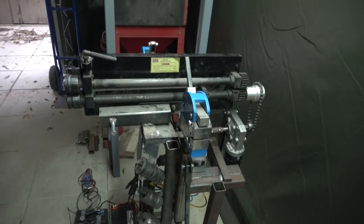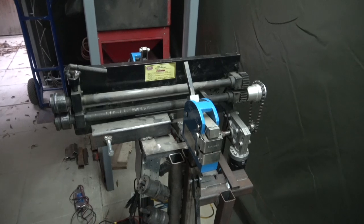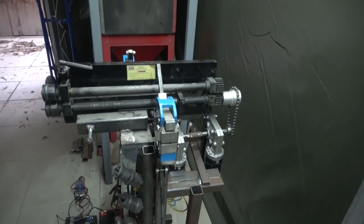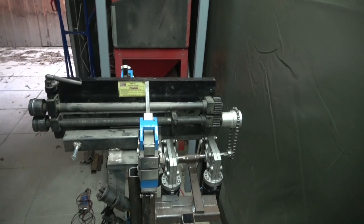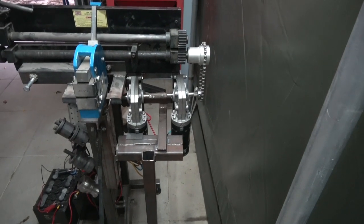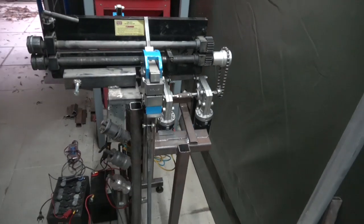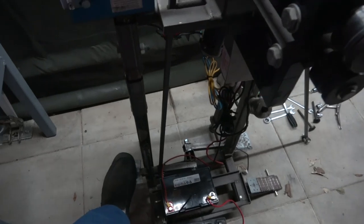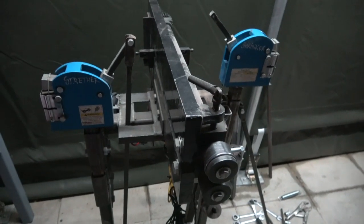This is from Frost Restoration — it's a hand roller. Originally when I bought this you would crank it by hand, but the problem is it's extremely difficult to crank by hand at the rate you want and hold the material at the same time. You really need two people — one feeding it into the rollers. So what we did is we motorized it using the two motors from the Toylander Land Rover. I also bought these shrinker stretchers and made them so they've got pedals on them — they're a lot easier to work that way.